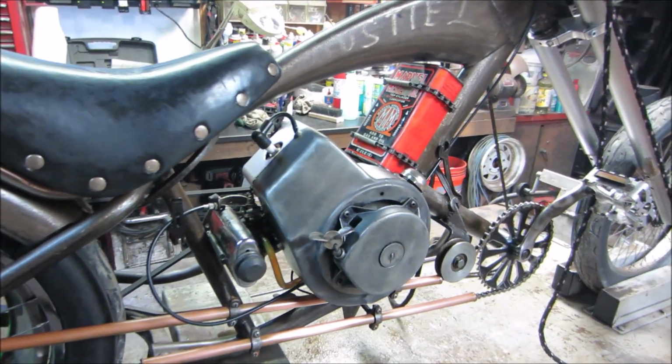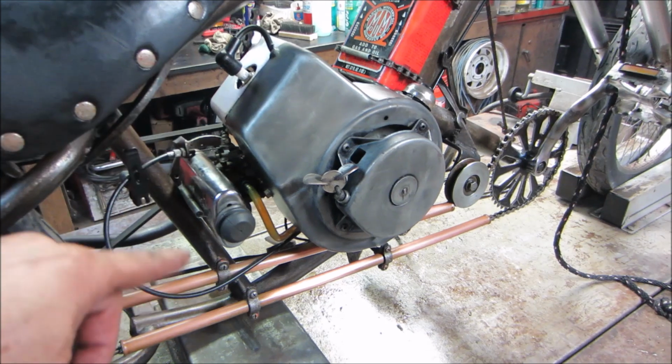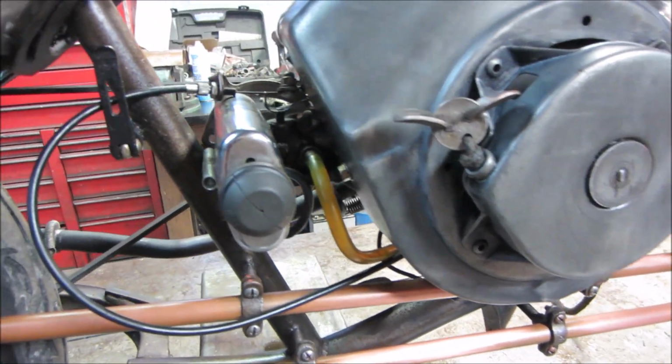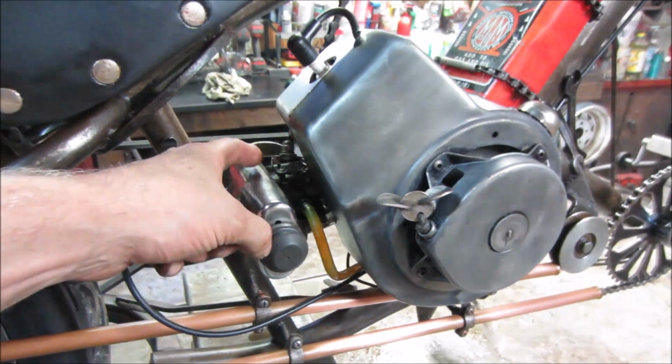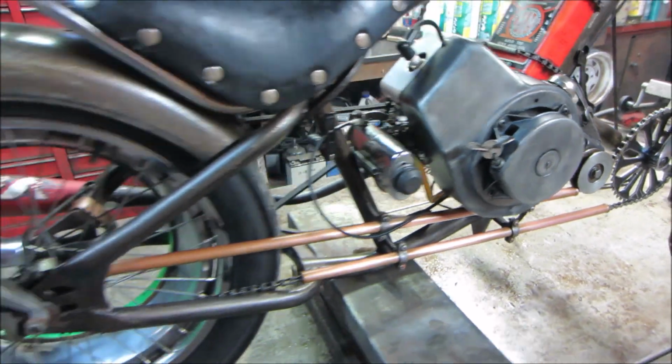That one's good. I think the fuel kind of has to run through it. I don't want to start adjusting the carb because I think once I put the fresh stuff in, it'll come right back to where it is. You can see where it's bogging a little. And I went to click it, one click on the choke, and it got better. So I think that's probably what's going on.